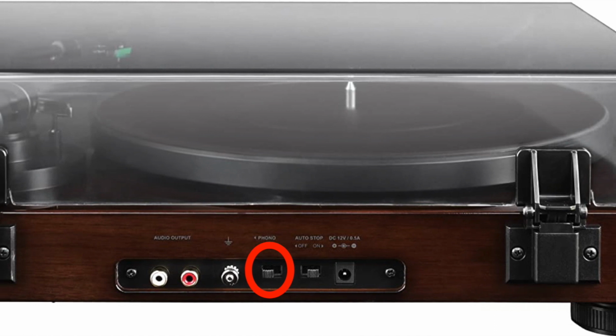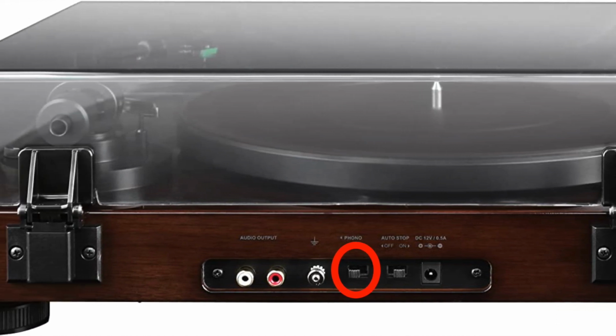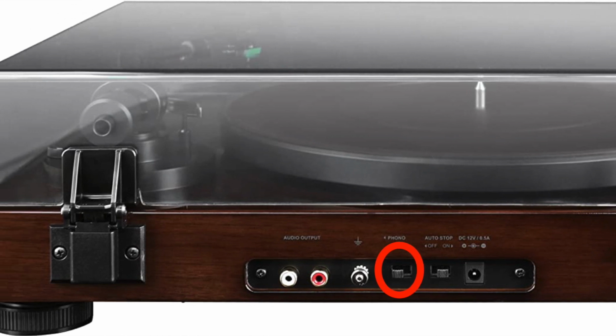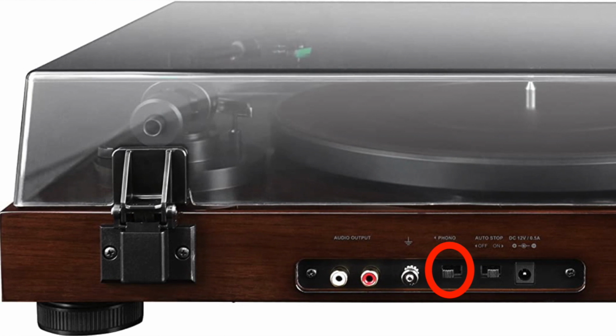On the bad side, well, including a phono amp, all those electronics in the sensitive turntable actually harms sound quality, because what you get is a whole host of vibration and high frequency noise coming from the internal phono amp, and this will affect the turntable all over, whether you're talking about the plinth and the platter and the arm and the cartridge. All of these components will be subject to bombardment of high frequency noise and vibration from the phono amp.